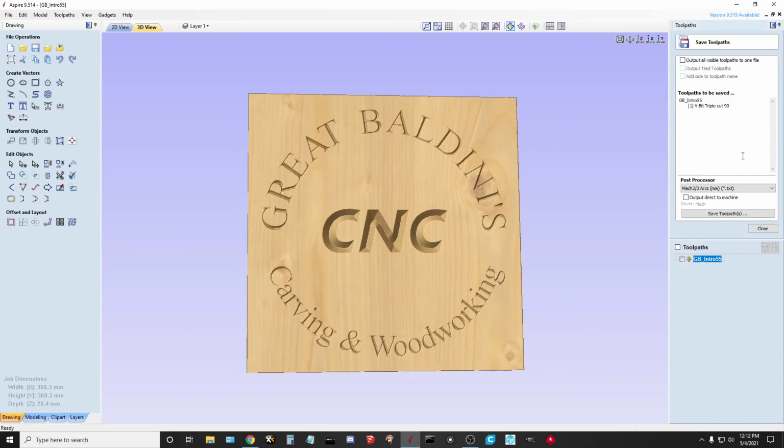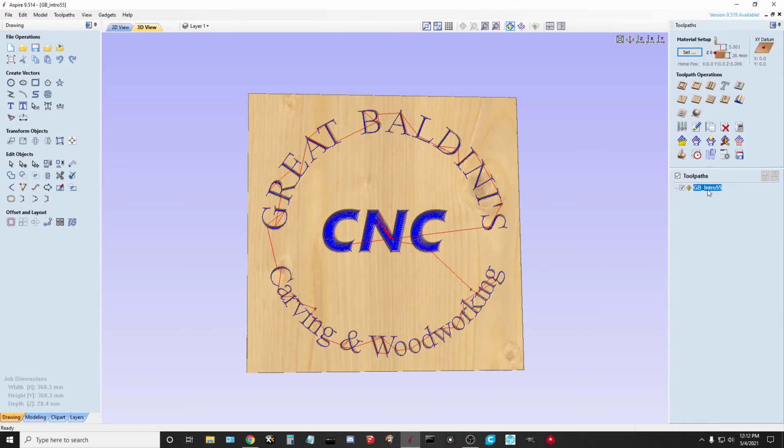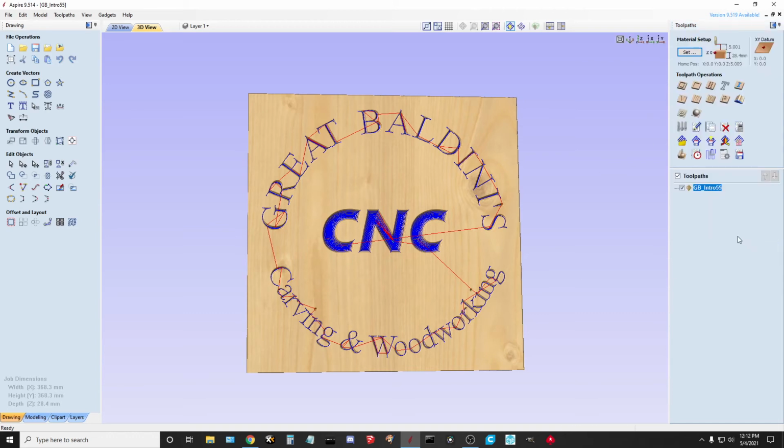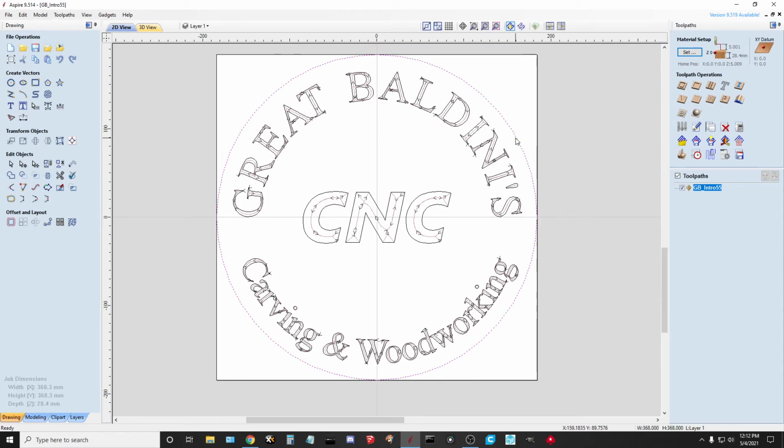I'm going to go ahead and I'm going to save. Now I have to export this. I can come to here to time. So it's telling me it's going to take 9 minutes and 49 seconds to do this. And that's very good. Now if there's other things I wanted to do, different shapes or different looks, I would choose a different tool path, a different bit, and I can make everything separate. I don't have to do everything at once. I could choose this or choose that and change bits out. But we're not doing that. It's just going to be the same bit across the board. So now we're all good.